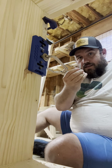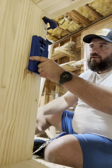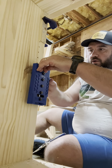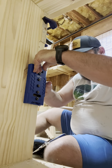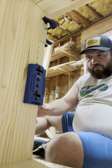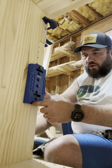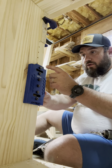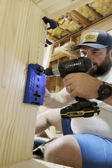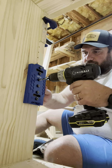This is where that guide pin comes into play. You want to pop your clamp off, take your jig off, slide the pin into that top hole, and set it in the very last hole you drilled. Now your jig is set back up for another row. I'm going to drill all these out and then drop it down one and drill one more hole. I know this is the perfect setup because I've already done it three other times. Make sure your jig stays pressed against the face of your cabinet.